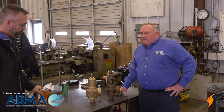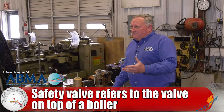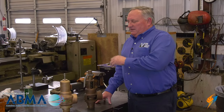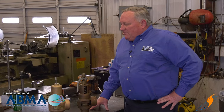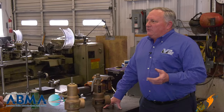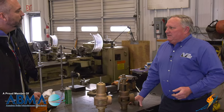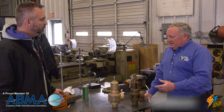A safety valve refers specifically to the valve on top of a boiler, as opposed to a safety relief valve or a relief valve. Safety relief valves or relief valves are typically used off-boiler in Section 8 applications, while the boiler is a Section 1 application. The safety valve on top of the boiler must reach its full relieving capacity at 3% over pressure — so if the valve is set at 100 psi, it must be in full lift and flowing at 103 psi.